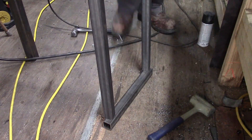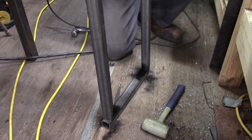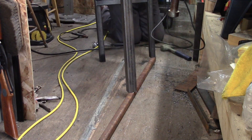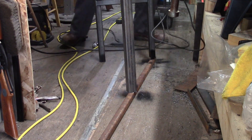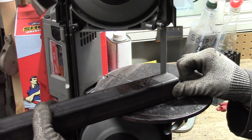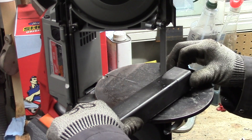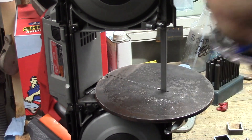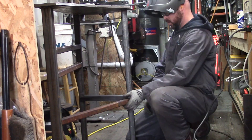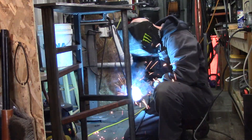This is a little trick I learned from watching Jimmy DiResta's videos. I wanted some cross supports, but since I had different thicknesses of material for the legs and cross tubing, an easy way to lay out a nice coped joint is to just lay the tube on top and spray paint it - that gives you a line to cut to. Once I cut those out with my bandsaw I've got a really nice tight fit - a very nicely coped piece of steel that makes for great joints. Just measure those out, get them even, and weld it up.